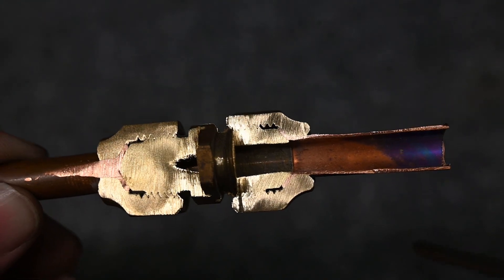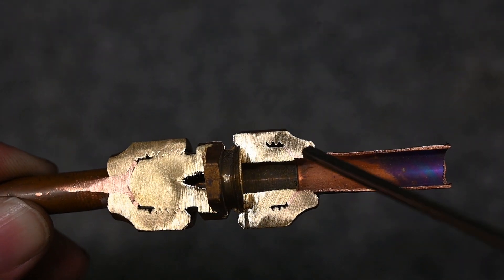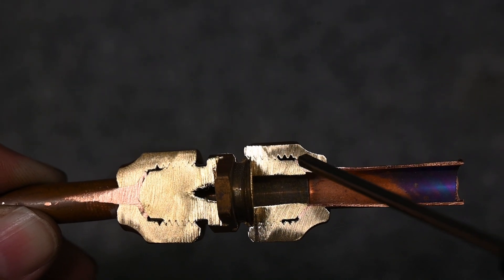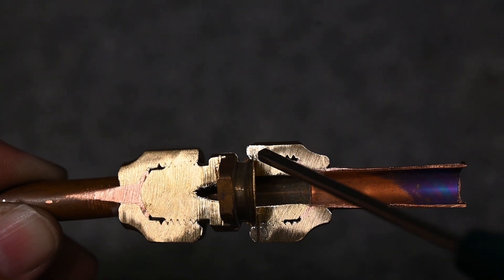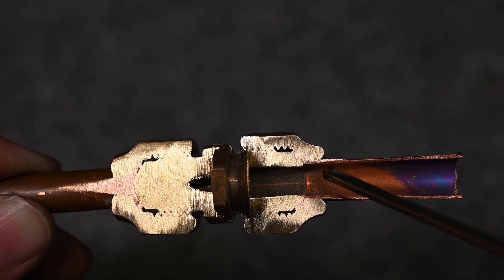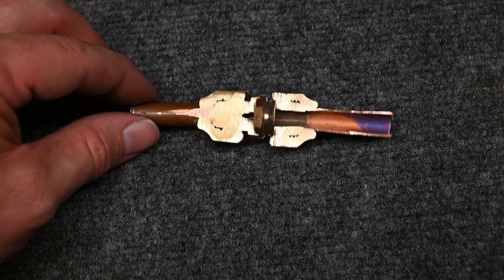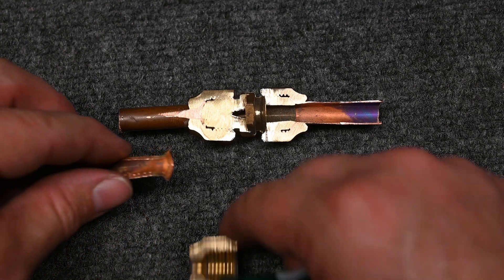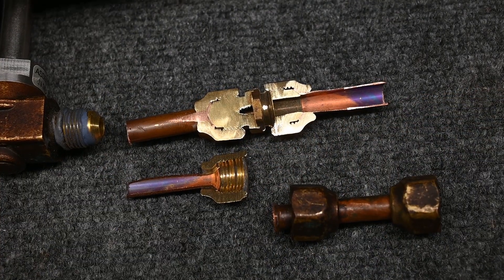Take a look at this one where we cut it completely open. Here you can see just this little bit of copper — that is right what's making that seal. That is our flare. Then you can see the flare nut pulled up here, and here is the other fitting. Once it pulls it all tight, it makes a good solid connection. It's got to be torqued correctly for it to hold. If we make that flare correct, it works good.